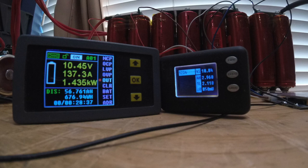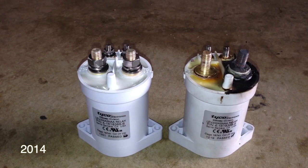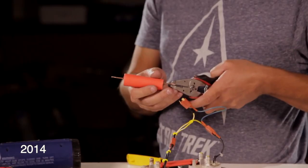This is a very effective way to have a very high output battery without a very expensive high-power BMS. I hope this video helped you. When the first contactor failed, my theory was that I hadn't tightened the nuts connecting the cables tightly enough, which created extra heat and caused it to fail. Make sure you hold it with pliers because it's going to get hot.